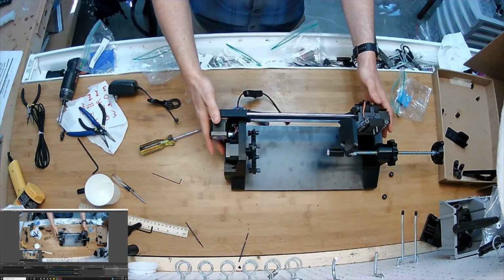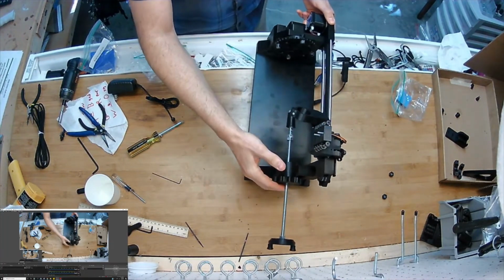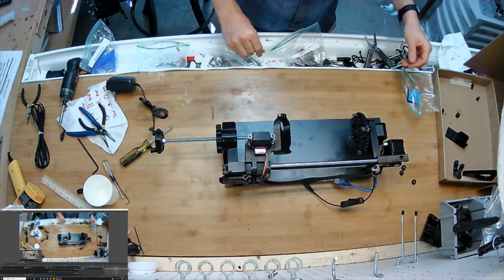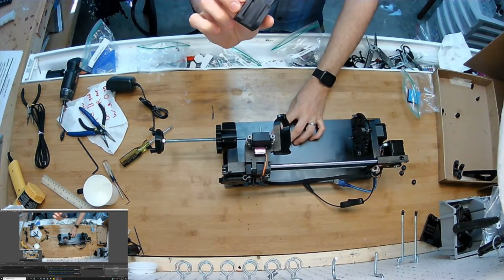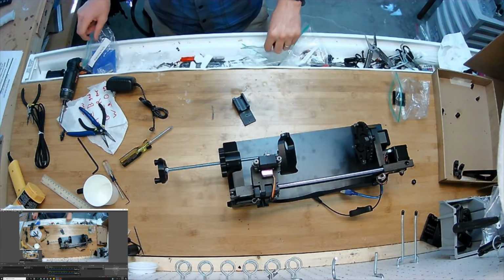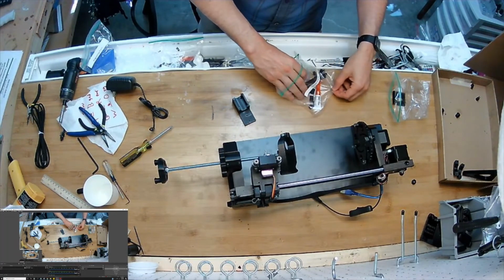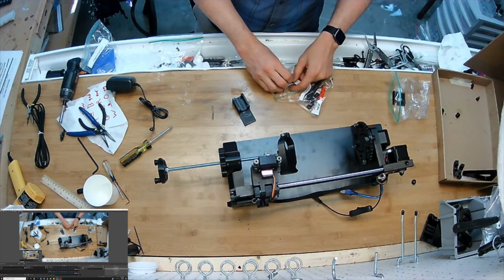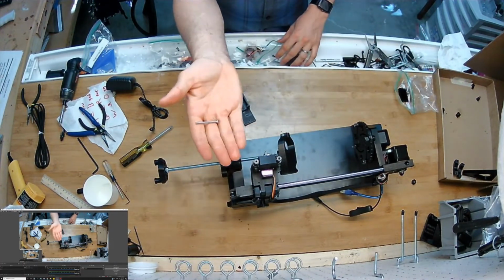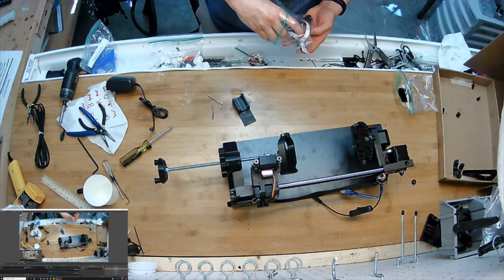And that is almost the entire thing. Flip this around. I actually forgot to finish assembling the carriage here. Flip it around this way. Scooch some of this stuff out of the way. This is going to be my pin holder. I'm going to use a 3mm nut. Let's see. I'm going to grab another one out of my spares. I guess I had used all of them. A 3mm nut, and then I'm going to grab the only long 30mm 3mm screw. Oh, and 2 nuts. Like that.